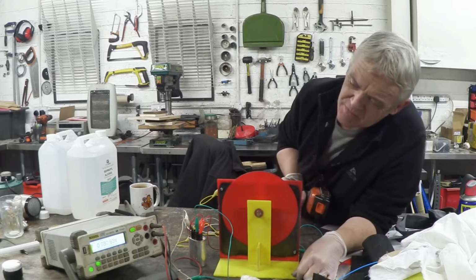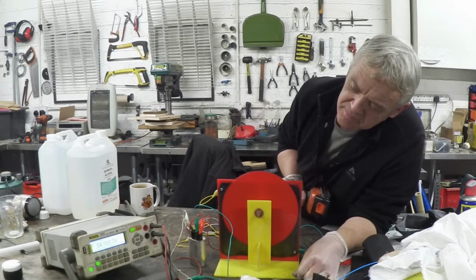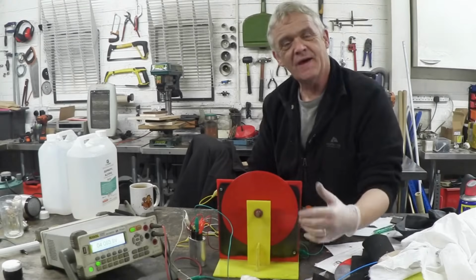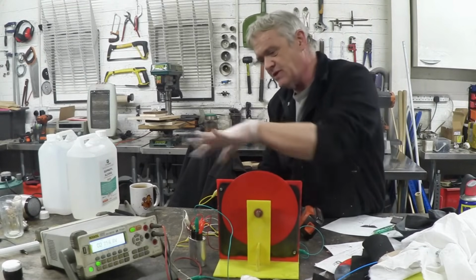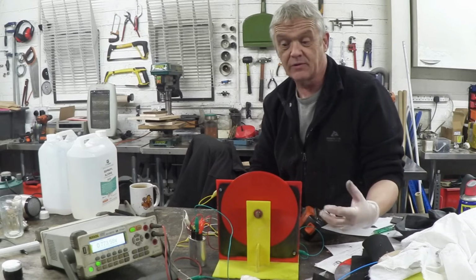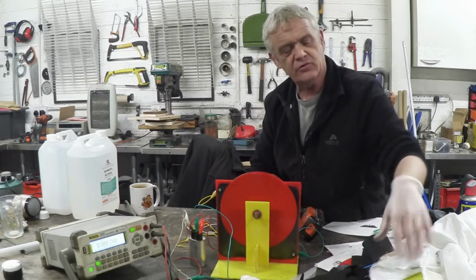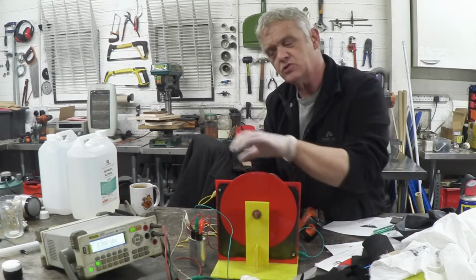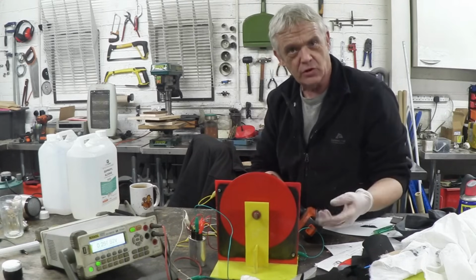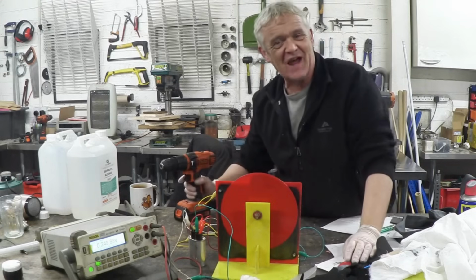The other cool thing is if I keep spinning that, then the effect lasts. Now, this construction I've got is on my dirty bench. There's lots of wires, so it's got a fair amount of leakage. So the electrostatic charge I put on that plate will in fact leak away relatively rapidly. We need to improve it against leakage for that to retain. But that slight rubbing that we did with the carbon felt or the cotton wool transfers enough static onto the surface to make this work very much better. Instead of being a volt or so, it's now getting up to 6 and 10 volts, and that will actually last. Now, personally, I think that's astounding.